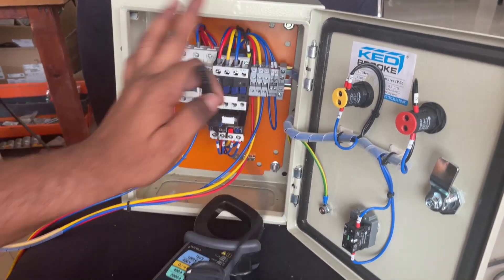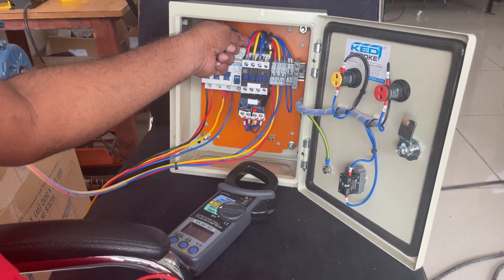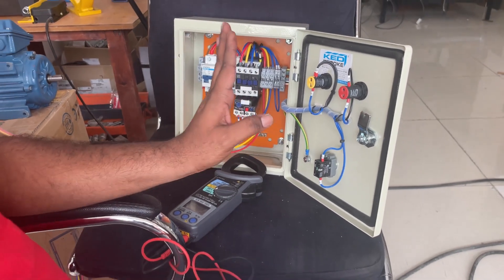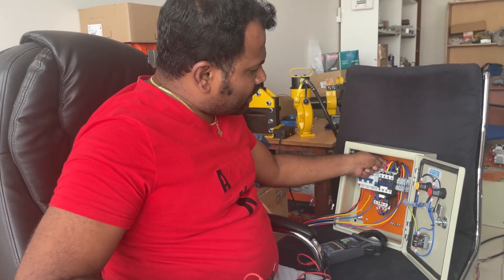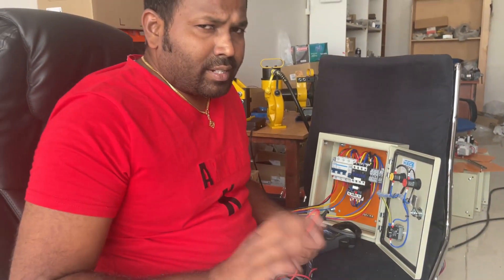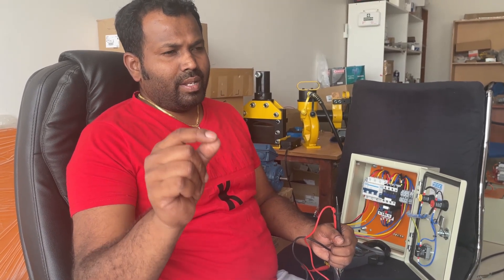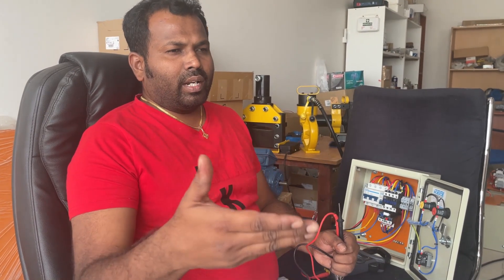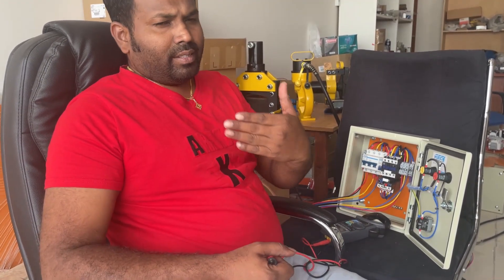Since A2 is neutral and connected directly from the neutral end, we need to trace the wire numbers step by step using the drawing. If you don't have a drawing, you check the wire number on A2 — this wire number is four. In control panels, wire numbers are given for every step of the control wiring. Whenever the control wire crosses any contactor, NC relay, or terminal, the wire number changes — like one, two, three, four — and you trace accordingly.